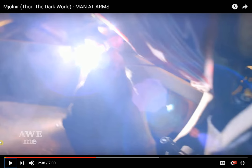Bingo. Yep. Imagine you could control a little tiny arc of electricity like a lightning bolt. It's basically what you're doing. You're providing a large bolt of electricity basically across this thing. It locally melts the metal, just like a lightning bolt would if it were to hit something, right? So now when it's molten, if that's exposed to air, you've got iron or something, it's going to form an iron oxide. That's the thermodynamically stable phase.